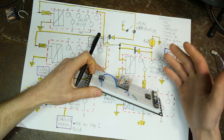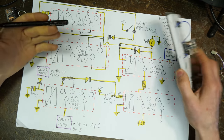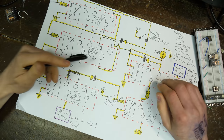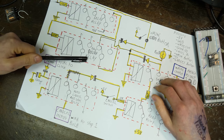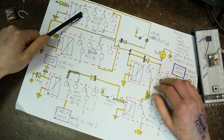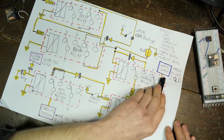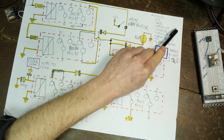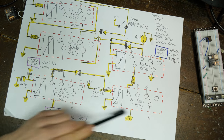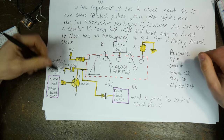For instance, you can use the relay's fundamental delay within its function as an actual delay to the circuit. So for instance, you can make this listen to itself for a lot longer. So it's got a delay relay, it's got a pulse relay, so it sends a pulse, it delays that pulse, and it goes into this setting relay, which saves the state, and then it sends this out into the sequence. So it sends it into a step, this step goes high, but then when this step goes high, it actually resets this whole circuit.